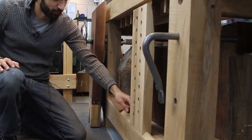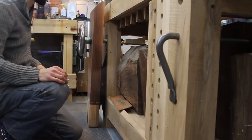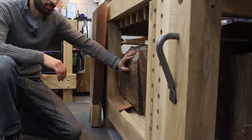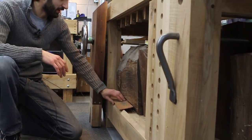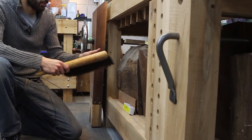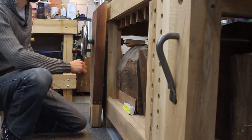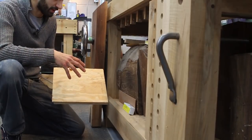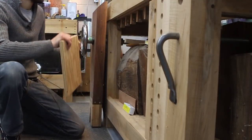That sliding dead man just slides back and forth on a cool little v-track. On this end I have holes drilled for storing my holdfast. Down here on the base shelf I have a whole bunch of bowl blanks which adds mass to the bench and gets them off the floor. I also keep my strop for sharpening chisels and planes, the stropping compound, and a brush for cleaning off the bench. I have a few jigs down here as well. Probably the most-used item is this piece of plywood — my backer for chopping dovetails and similar work, so I'm not chopping right onto the bench. It's a sacrificial backer and I use it all the time.